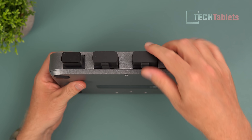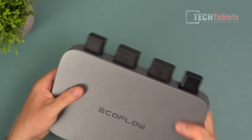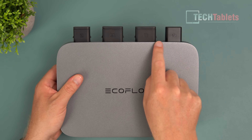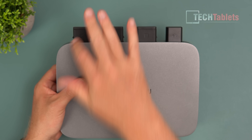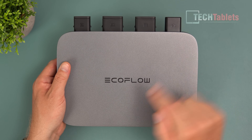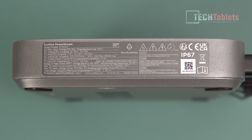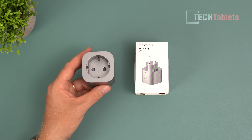The plugs have little caps that protect the components inside. They're clearly labeled so you can't accidentally put the wrong plug in the wrong position. This one is the AC out, and here's the wireless antenna - if it were internal there'd be no signal strength, which is why it's made external. The main takeaway from the specs is that it's 800 watts maximum output that it'll feed into your home grid.